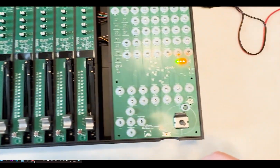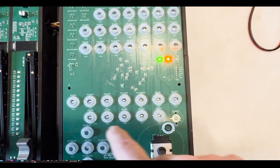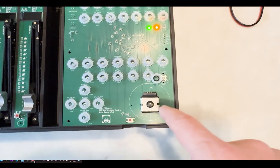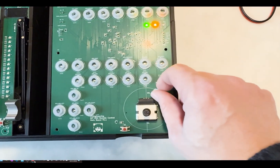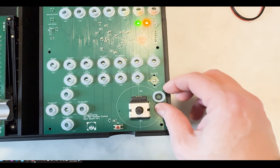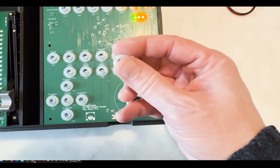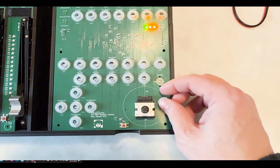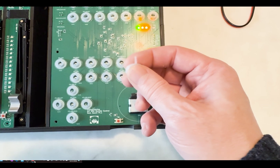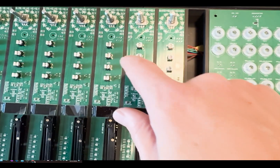What's new in particular on the new main board, which is now version 4.1? I have implemented membrane rubber buttons — I've made a video on how to produce footprints for these buttons. Membrane buttons are really cheap, very easy to use and assemble, and in my opinion more reliable in the long term compared to mechanical ones.